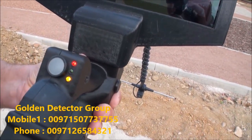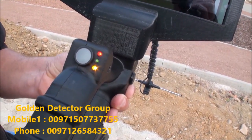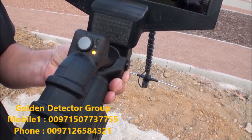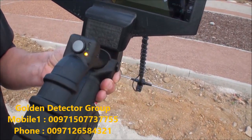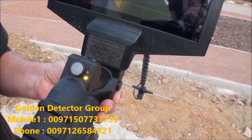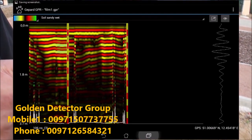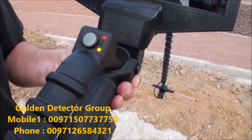With all three lights illuminated, the unit is completely ready to operate. To begin the scan, push the multifunction button. The green light will blink — the red light is off, meaning it is no longer stopped. With the green light blinking it is transferring data, and the yellow light indicates a successful Bluetooth connection. You can look at the data coming in on the screen. To stop the scan, push the multifunction button again.